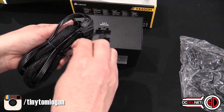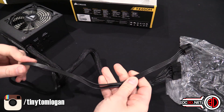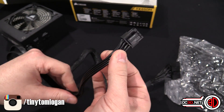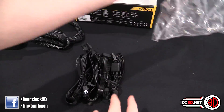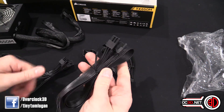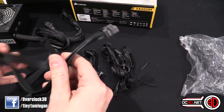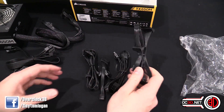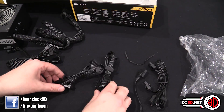When we open it up, you have your normal 24 pin cable with black cables — black with braid over the top. There's also your 4 plus 4 which is your CPU power that goes on the top left of the board. You can split it if you want but obviously you just bang the 8 pin in as needed. The other cables in the package are two daisy-chained PCI Express connectors — they connect on one side of the power supply but you get two PCI Express connectors at the end. They're 6 plus 2's so you've got the ability for 6 pins or 8 pins. Then you've got a run of 4 Molexes and 2 lots of SATA cables.